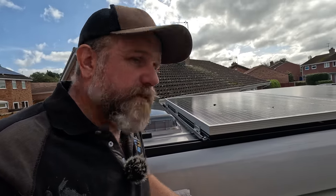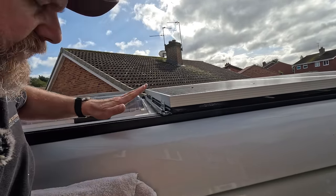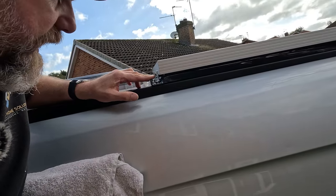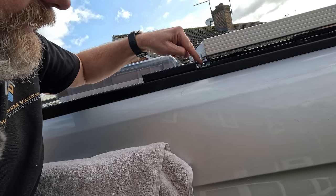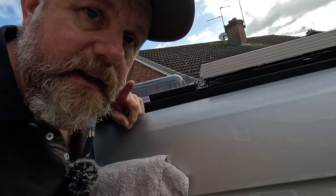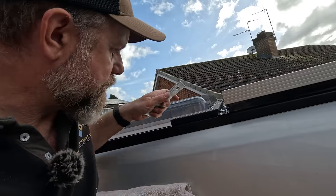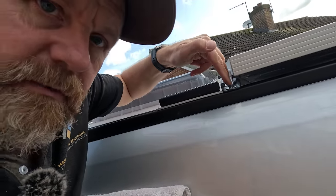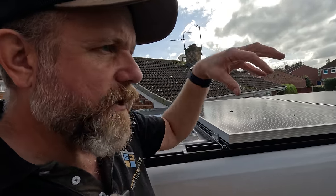These solar panels were not the most fun thing to fit and I really don't want to take them off. What I'm thinking I can do - looking closely here - that's my main unistrut, the big thick 40mm bars. This is the 20mm stuff that sits on top that the solar panels are fixed into. What I'm planning is adding another small section of unistrut, taking this off, putting it on top and fixing it down - that will get me exactly the 20mm I'm looking for. If that's not enough, I've also ordered these plates - I've got painted ones in the garage - which will get us at least another 3 or 4mm. The front solar panel, where the fan's going to be, is actually going to have to fold out of the way while I cut the hole and fix the fan.